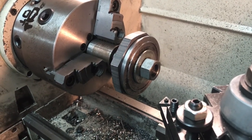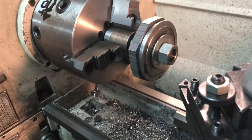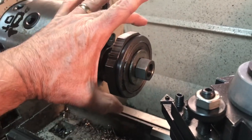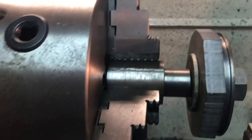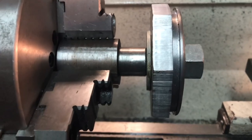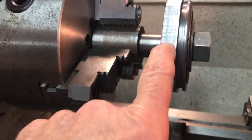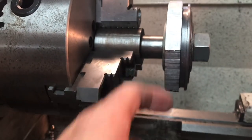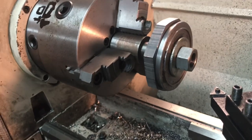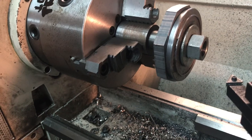Starting on the hand wheel portion of the tool holder. As you saw in the previous update, I showed this - it was a square piece of steel, about three quarters to an inch thick. It was the closest thing I had in size and shape to the hand wheel that needs to be made. I've cut the edges off on the bandsaw, sanded down the rough spots, and drilled out the center to three-quarter inch. I've got it on the arbor and the first order of business is to turn it to a uniform three-inch round.